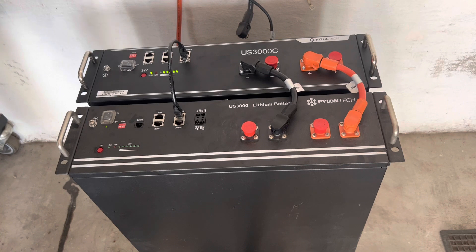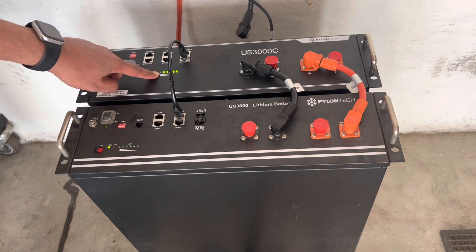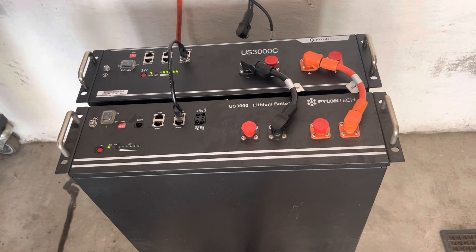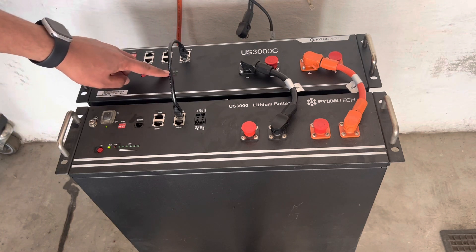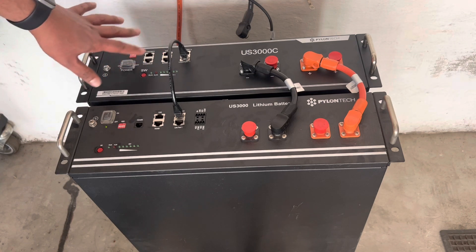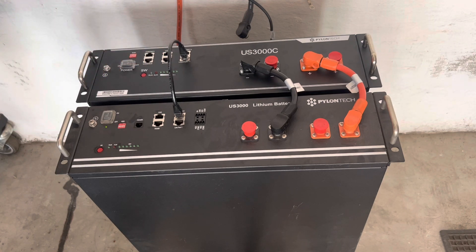You'll notice that the new battery's state of charge is not as high as the old battery, so the last light is blinking just to indicate that the new battery is charging. The lights have now gone off which means they've balanced and are both happy. But if you find your new battery only has four lights on, you can leave them connected like this for a while and the old battery will charge the new one. Alternatively, you can connect your new battery to your inverter, charge it until it reaches a full state of charge like your old battery, then remove the old battery and connect them together again.